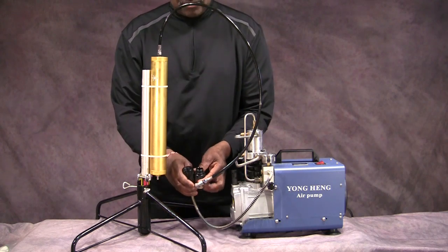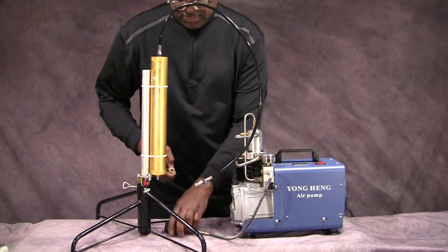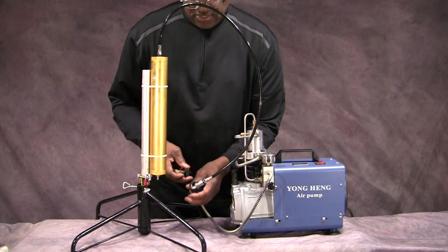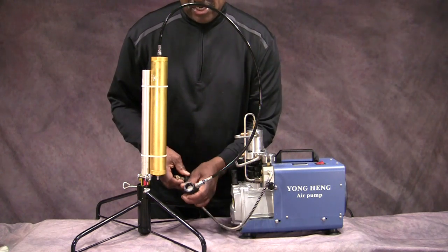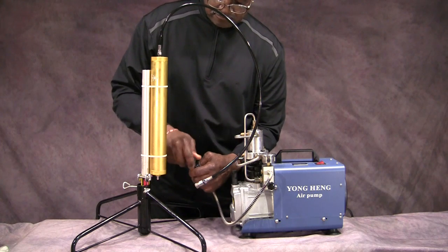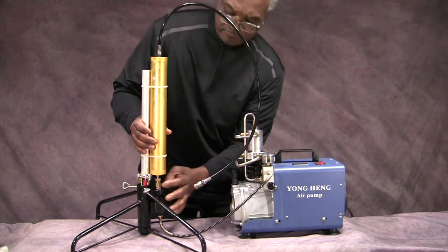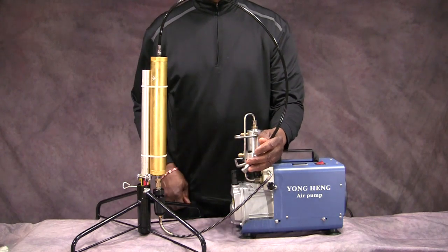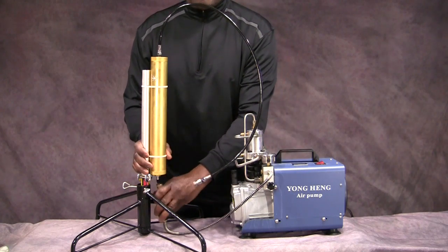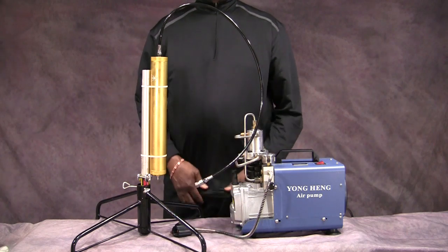Hopefully the remaining moisture will condense and go into the air. When I come back to fill up my gun next time, this gives me a checkpoint — I can look at this cotton and see if it's turning brown. If it is, I know it's saturated with oil and I need to put a new one in. I can visualize that at every fill. Then I screw this back together, pop it on here, start the system up, power it up, and go through the same steps: depressurize, shoot the water out, take this off, let the water drip, take the cotton off, let it evaporate, and my system stays dry.